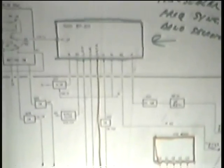So that simplifies servicing, doesn't it? If any of those things are giving you trouble, you change the tuner. Is the memory also on the same block? No, the memory is down over here as a separate item. Is it actually outboard? Outboard, yeah. So we have the controller chip directly into the tuner now. We've eliminated all these other things that can cause us problems. The memory is outboard and is still accessed in the same way. It's the only real change.